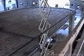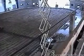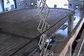If you're building just an ice rink itself, it makes a lot of sense to rate the whole common lobby area and the ice rink as a complete A1 occupancy. It reduces an awful lot of expense and construction hassle.